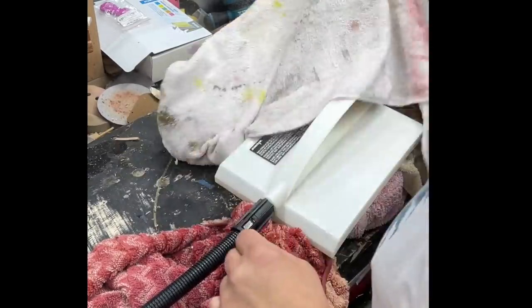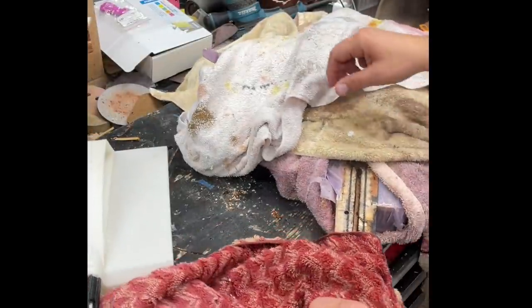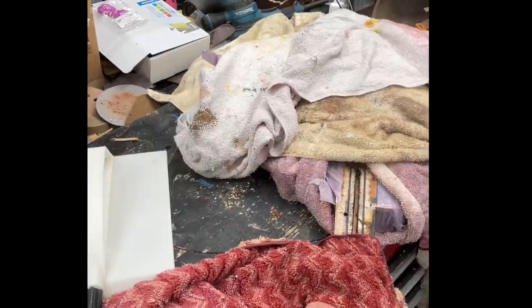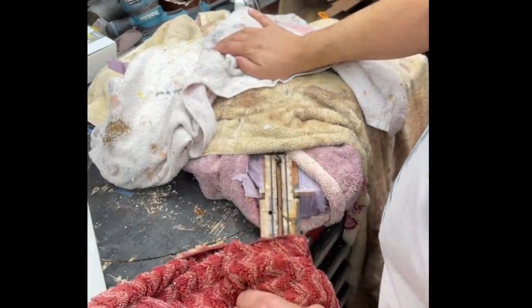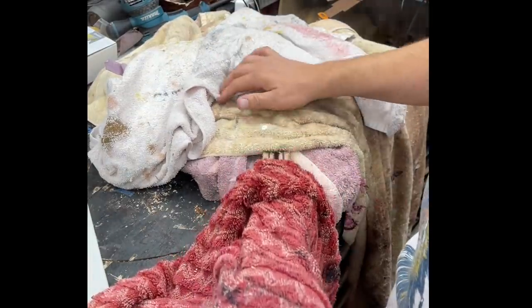The finish dried out but wasn't as cloudy, and I've got to sand some of the finish off anyway. I've got a Wagner steam generator — drop a towel over it and let this sit for about 30 minutes. Here's the steam generator on the floor. Be safe, guys. You can start seeing how much steam is coming out. About a half hour later, I probably could have pulled this at 20 minutes and it really just comes out nicely. The steam worked great. Really, drilling those holes — it just slides out. Not as easy as the hide glue with the '54 that I did, but probably caught it right at the perfect time.